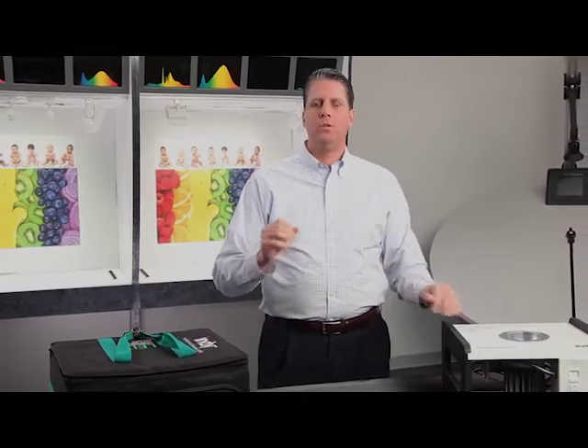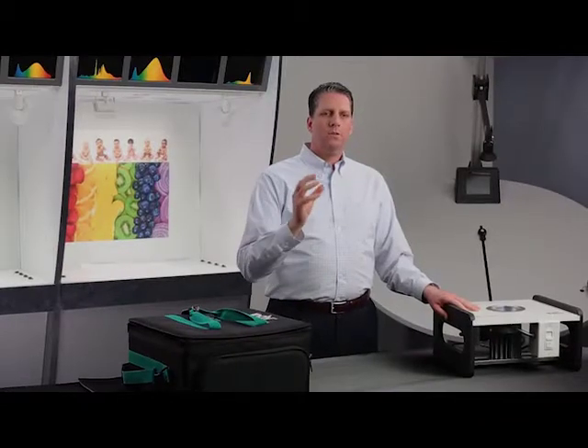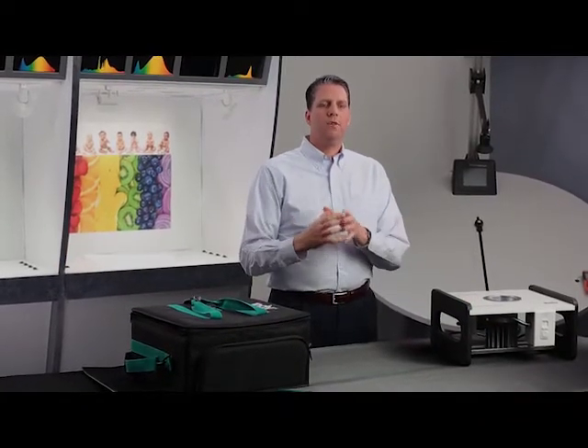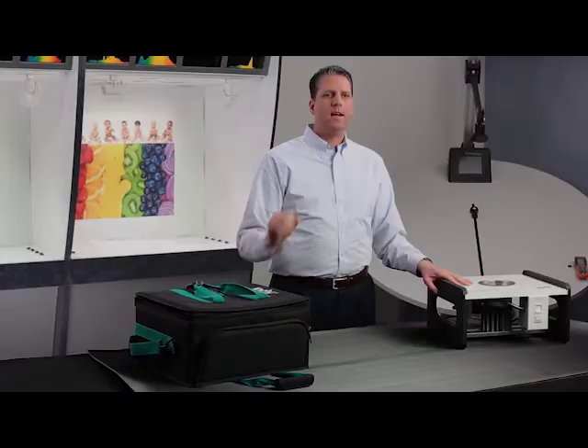This high quality of light is maintained by our LED module that uses a closed loop calibration system to perfectly render the white light right on the black body locus. It's almost like a computer inside the module that will increase or decrease the current or the power to the different LEDs to mix them perfectly to stay right on that black body locus. It also allows us to maintain the color temperature and delta UV throughout the entire life of the module, because different colors will degrade at different rates. This system measures the rate of degradation and decreases the power to the other LEDs to ensure that you always have that constant color temperature and delta UV on the chromaticity diagram.